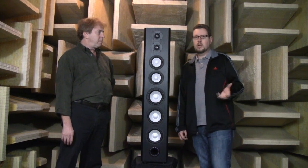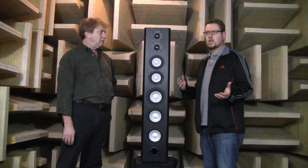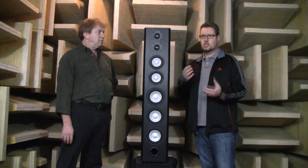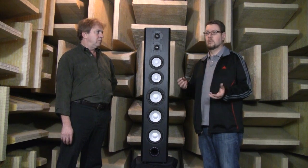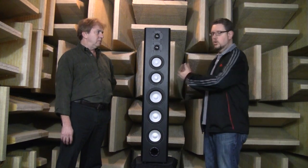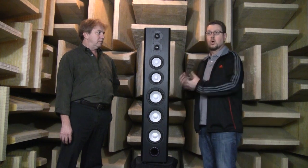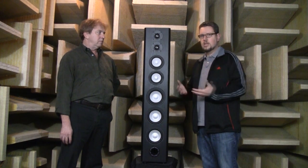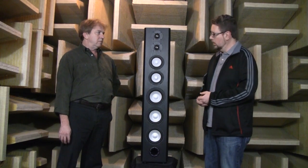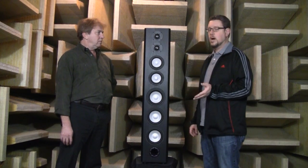The other thing to remember is that when you've got only two loudspeakers carrying the full range and you want really high dynamics, you're not splitting that output level between five or seven speakers and subwoofers anymore. You have to get that out of two speakers. So in large spaces you need to run more power through the speakers to get that satisfying dynamic level up. Power handling was therefore one very important thing — and in the tweeter, dealing with power handling was also critical.